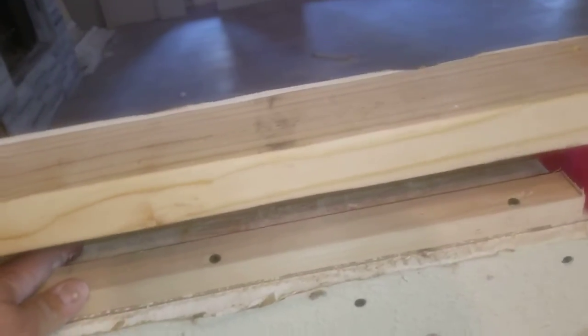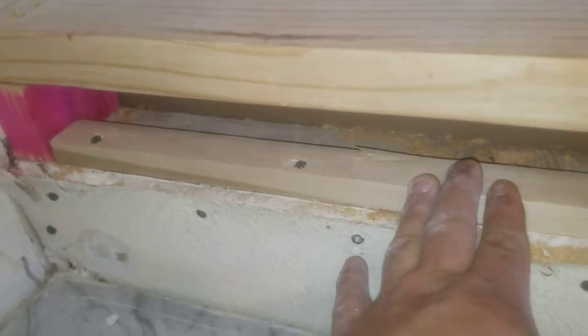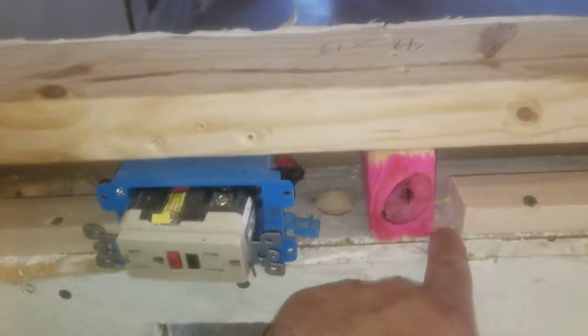Instead of cutting all that, another way to do it is just taking little pieces of scrap wood. We already have the bar top on there and want to do it before the granite comes, because then it'd be so hard to get in there. I just took little fur strips or one-by-twos from plywood and literally just drilled them in at an angle to toenail them, lining up at the bottom toe plate.